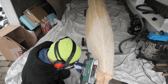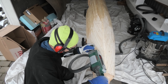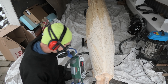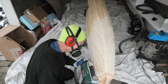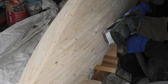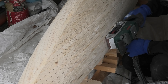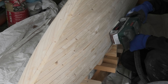It will probably be some epoxy left in the deepest valleys. Here for example I didn't glue on enough wood and the hull is getting too thin. I will have to take other measures later on. In this area I have a similar problem but less extreme. First I focus on removing the epoxy in the lower spots by using the edge of the belt sander.